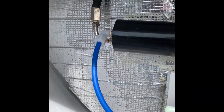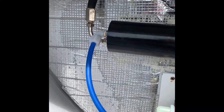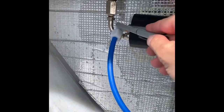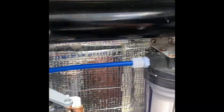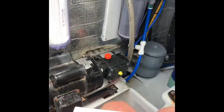This is the membrane here. Water goes in on top, across, and then the outlet of the membrane goes into the cupboard in the master bedroom where you adjust the pressure to 800–850 PSI. That back pressure to the membrane is what forces the water through, and then the drinking water comes out here through the blue pipe, which goes through a pH neutralizer filter — I'll replace that as well.